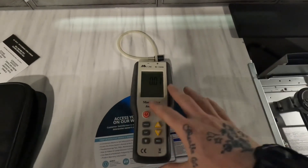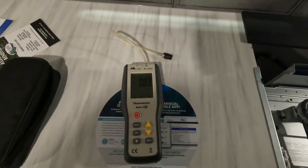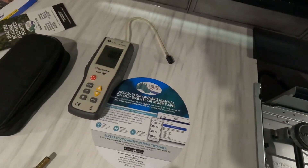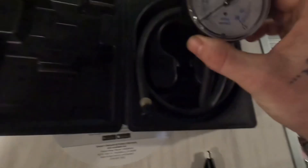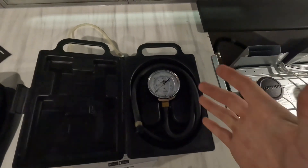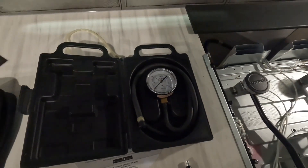As far as the tool goes, the manometer itself — which is how we're testing this pressure — you don't need a fancy one like this. If you're just wanting to check your system, a standard manometer from Amazon works fine. They're all really the same: it's just an analog dial with a tube on the end, same as my digital one, just not as fancy. One of these can be had for about 40 or 50 bucks — really cheap insurance. You know how to do the test now and you can check for leaks yourself.